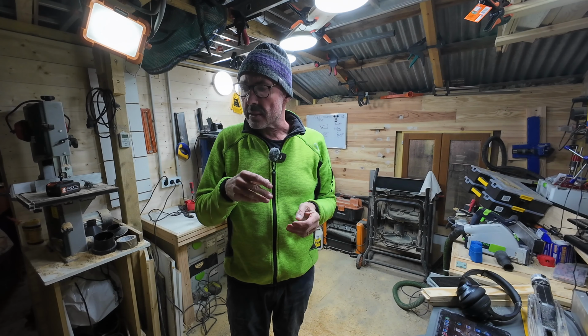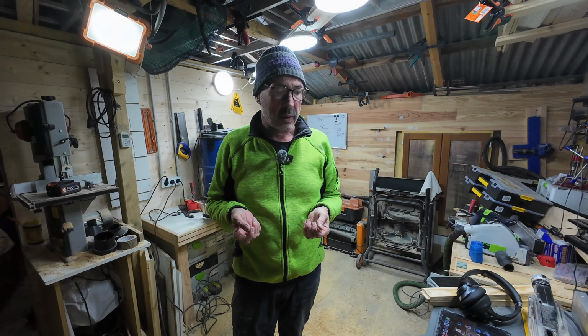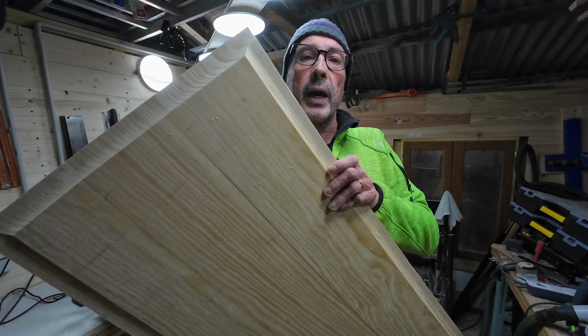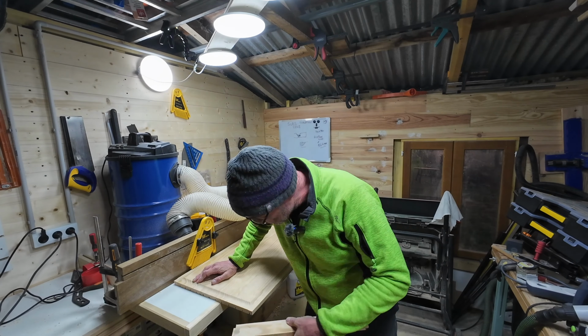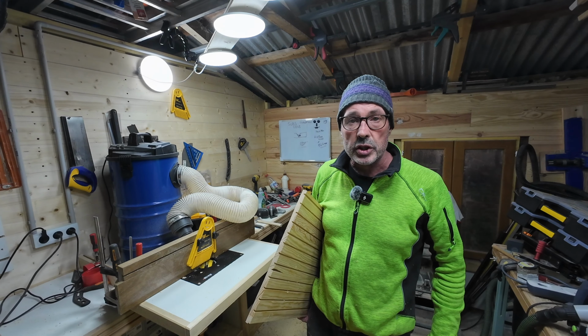Giving it 3 passes, and that's taken about a quarter of an hour, I think. And it's 8 o'clock now, so I'm going to knock it off just because I don't want to annoy the neighbours. So after 3 passes, looking okay, cutting really nice and neat. There's no chatter, there's no tear out, so I'm happy with that. I'm guessing a millimetre at a time, I've got 6 millimetres. Right, I'm going to call it here for tonight. I shall see you in the morning.